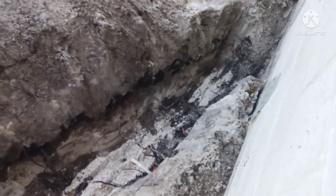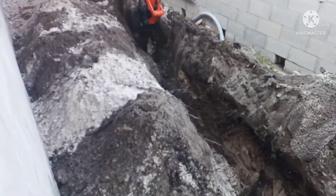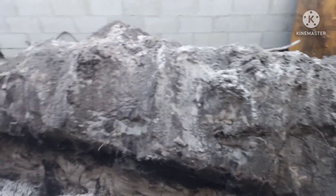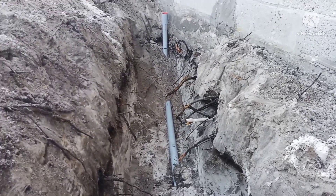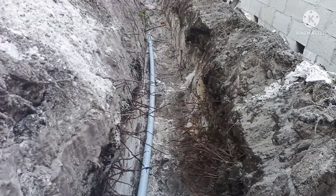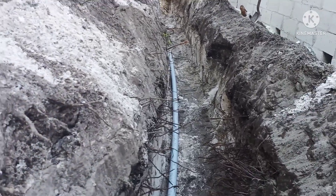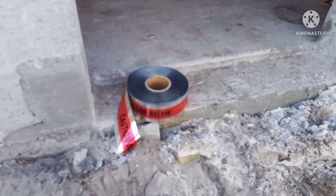The ditch is going 30 inches deep. Now we got our FPL pipe halfway in, and we're going to get our low voltage in as soon as it gets glued up — 30 inches to the top of the pipe. We got the low voltage sitting there, we'll backfill a little bit and get ready to lay that in a few minutes.